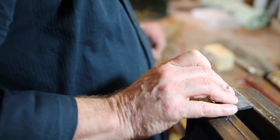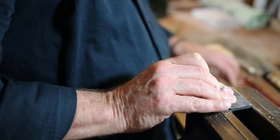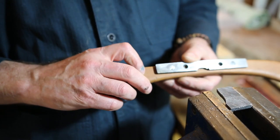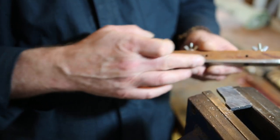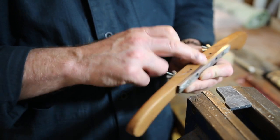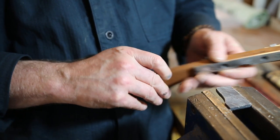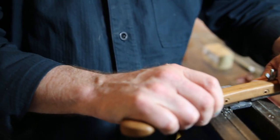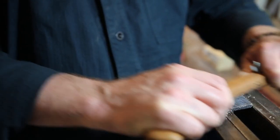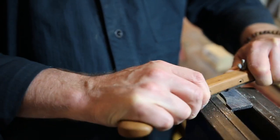It's a little coarse here, maybe I'll scrape it a little smoother. This is a scraper I made for some bronze plaques I had to prepare — just a piece of hardened steel with a very acute, obtuse angle, a bit like a version of the scrapers. I can just use that to get rid of the tool marks. This is also helping to flatten the surface.